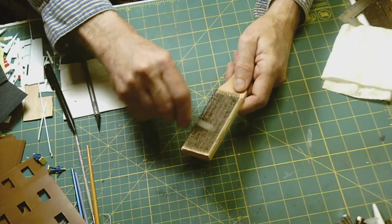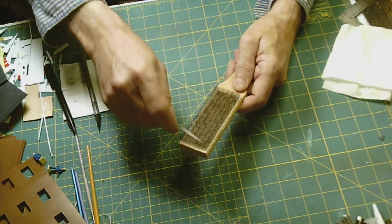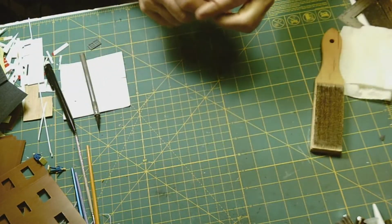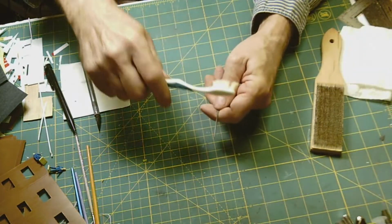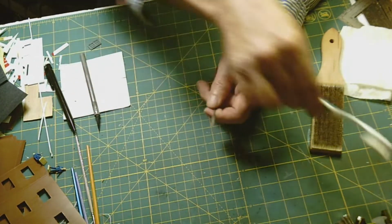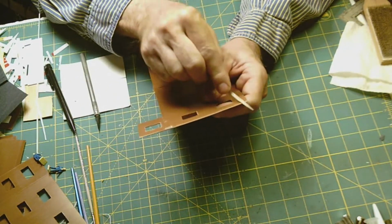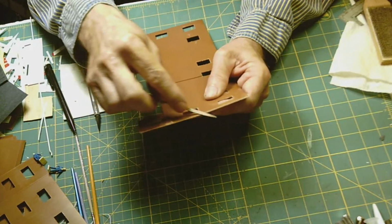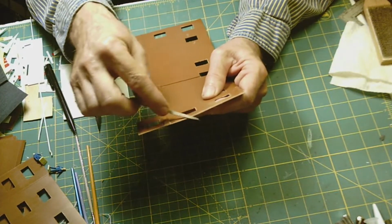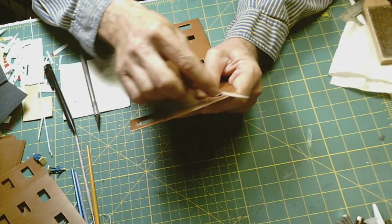And then when I'm done sanding it down, I got to file it. I have a whole set of files that I just strictly use for nothing but plastics. The plastics fill up the teeth in these files just so fast that it's just good to keep them clean and using for nothing but plastic. So here I'm just cleaning out my file and getting ready to take down the edge. Now when I did the 45 on the sandpaper, I don't take it clear down to the point. And it's just good to come back with this file then and just take everything down to a really fine knife edge on that outer edge of the plastic.